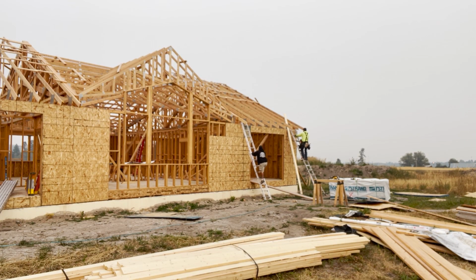After trimming off all of the rafter tails, it was time to start putting up all of the sub-fascia. We needed to get all the sub-fascia on prior to starting the roof decking, and so we're moving around the house slowly but surely.